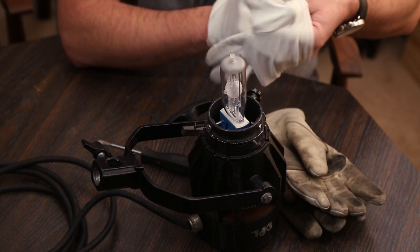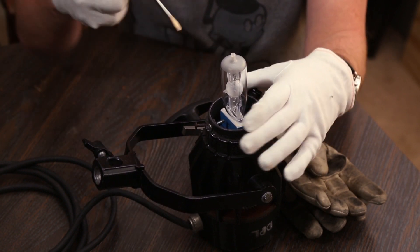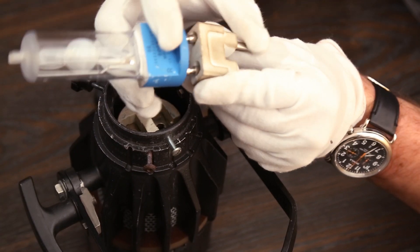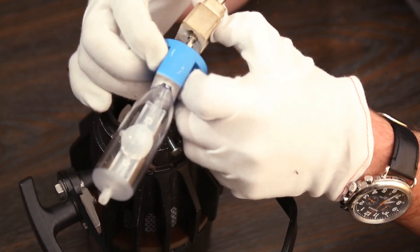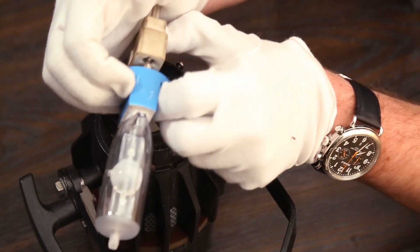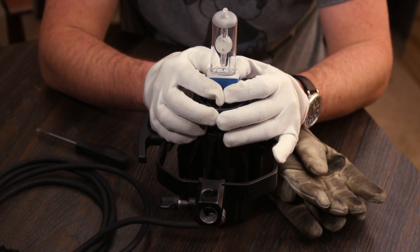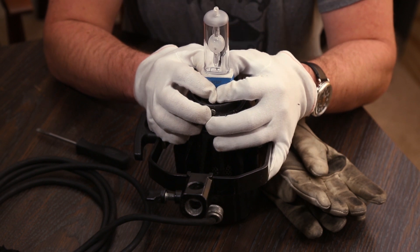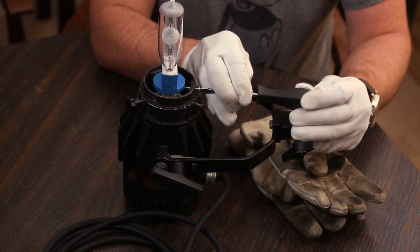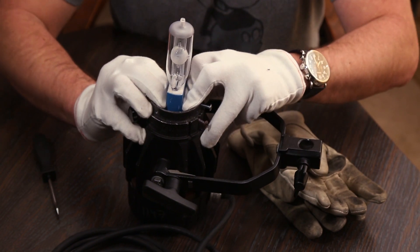The rental house was generous enough this time to give me two clean gloves. Clean gloves around any globe — really, really important, as I said in part two. First, we'll remove the globe from the head unit like I showed in the last episode. Then attach the globe to the extension by lining up the male and female ends and just squeeze or push them together, and push both of them back into the head. A happy mistake I made while shooting this: make sure to back off the screws closest to the globe, because the lip of the globe won't push past the screws if you don't do that, and therefore the globe can't seat properly in the head. Grab a flathead screwdriver and back those screws off until the lip of the globe clears the screws and pushes all the way back into the head unit.